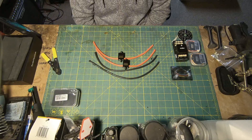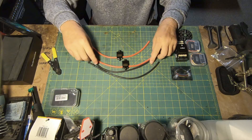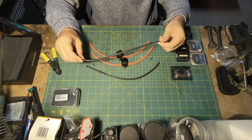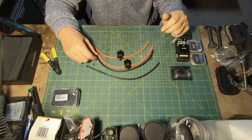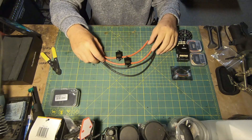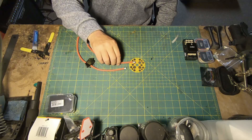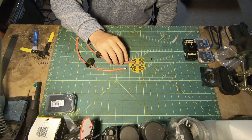First off, you want to get some wire that is similar in length, although the lengths may depend on the size of your build. I'm building a 1200 millimeter hexacopter with a fairly large plate, so I'm going to use exactly what they've given me. Your first order of business is to cut your negative lines to the same size as what they give you in the Mach kit. This is 8 gauge silicone wire, very easy to work with and pliable. I will be soldering them to XT90 plugs. I have cut around an inch off — you really want to make sure you have a good amount exposed.